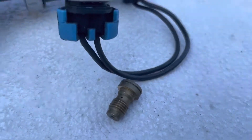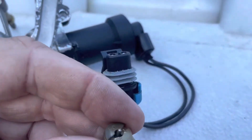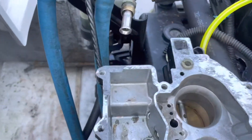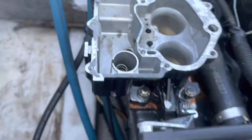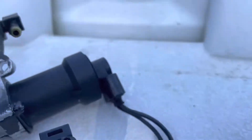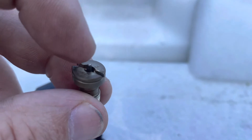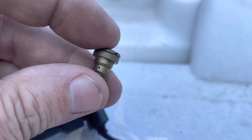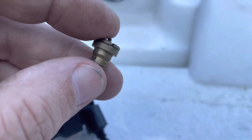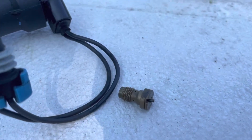The reason for this video is that this power valve sits in the bottom of the carburetor — right down in there, in that little hole right there. It sits in the bottom of the carburetor where all the dirt collects. If any dirt enters this power valve, it's going to get into those tiny little holes and clog it up. So if you feel like your boat is down on power, it could be a clogged power valve, which I believe is what's wrong with this boat.